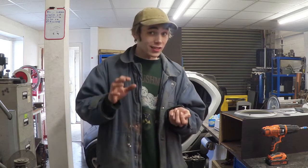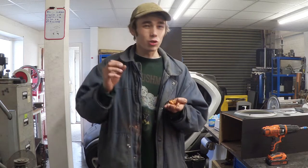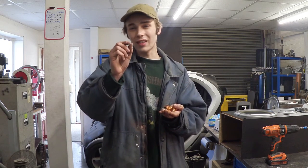I actually managed to pull all the toroids off the circuit board without damaging a single one, which is awesome because now I can reuse these in a project that I'm working on right now. Like I said at the beginning of the video, you want to be really careful when you're removing silicon components. You should be able to remove anything as long as you're really careful with the heat and really gentle when you're trying to tap the pins off in the back. What actually helped me is when the pins were getting stuck, I used a little flat head as a pry tool just to get the last little bit out of the actual circuit board.